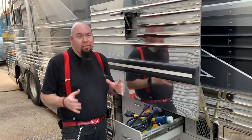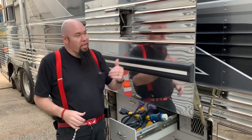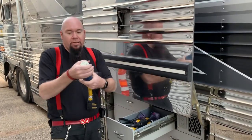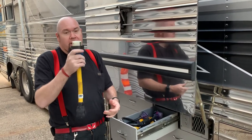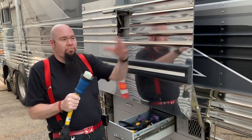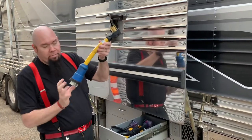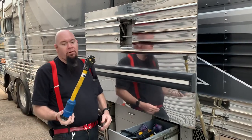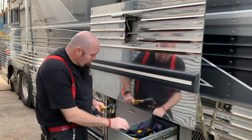You're not always going to have 50 amps hanging around that you can plug into for this thing. On my rig and a lot of rigs like this, you've got this big honking 50-amp twisty service. That's impossible to find — the only time you find a plug like that is on certain major commercial generators. So you have to have an adapter like this one. Mine plugs into this and then into the 50-amp service, so whenever I go to a campsite or park I have to use this adapter.